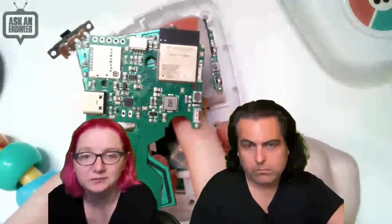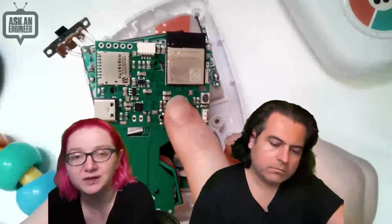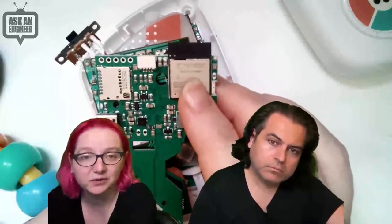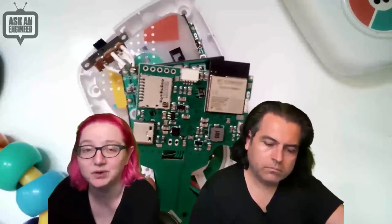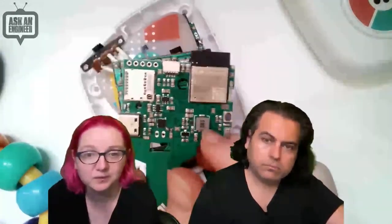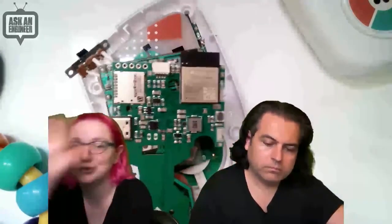The two battery connection tabs get soldered directly to the circuit board and boosted to 3.3 volts to drive the ESP32-S2. The reason I went with Wi-Fi is so you can wirelessly program it - once it's in the case, it's really hard to get to, so you don't want to keep opening it every time you want to change songs or code. We use our Wi-Fi workflow to wirelessly program it. And of course, NeoPixels - five of them, almost twice as many LEDs, and they're RGB.